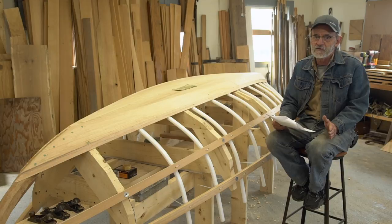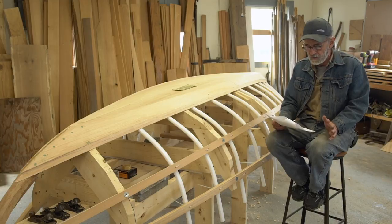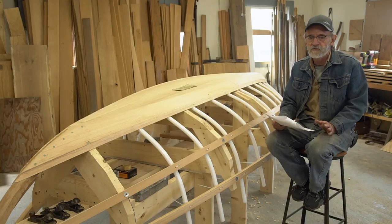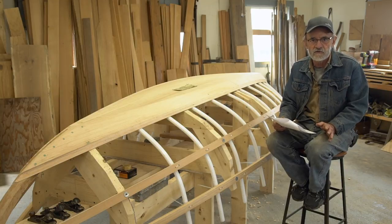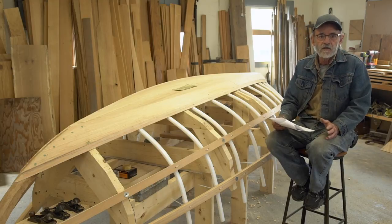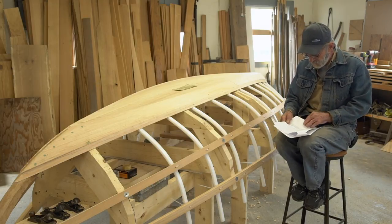If you're talking about setup, the way you set them up is to sharpen them up properly, and I think I've got a video on how to sharpen block planes. It's something that you have to learn in order to get the proper use out of a block plane. A block plane, normally you've got it in one hand, and if it's not cutting properly, you get very little use out of it. So it's got to be sharpened up right. I kind of like the high angle block planes, and I'm just going to go on from there to the next question.